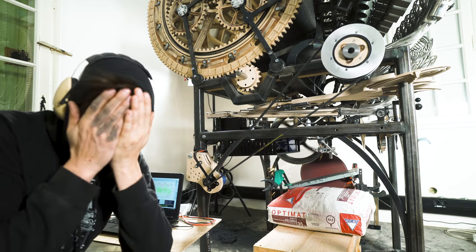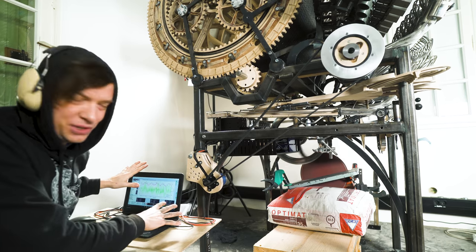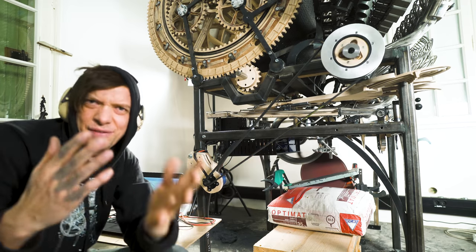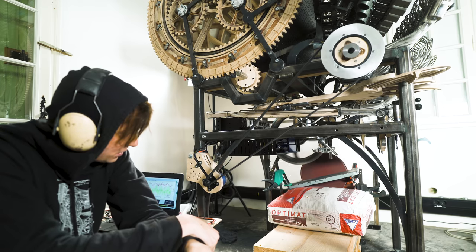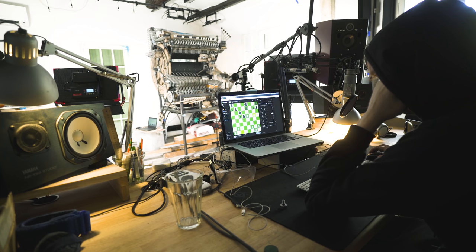3 days grinding. I really want to get this right. I'm using the computer now with electric motor, so it handles itself. I don't have to be by the machine all the time. I have to take very light cuts, otherwise I can't get it to run true. It's getting better and better all the time, but 3 days.